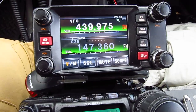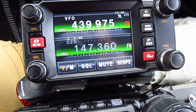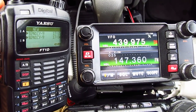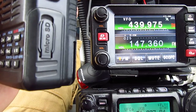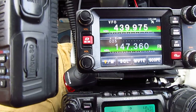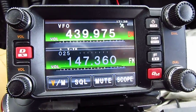In order to send and receive messages, you have to have a micro SD card inserted in the radio. In this case we have one in the FTM-400, and we also have one in this other radio which is the FT1 — that's the radio I'm going to receive the message on. If you don't have the micro SD card, you will not be able to send messages. It's very vital — you have to have a micro SD card inserted in both radios.